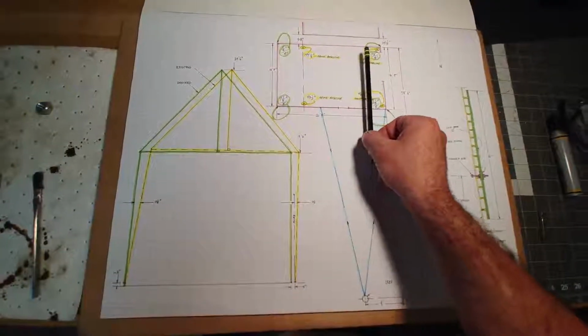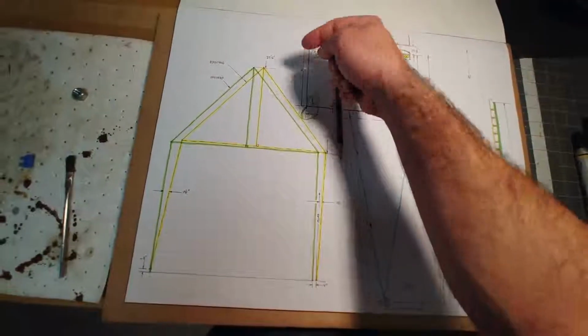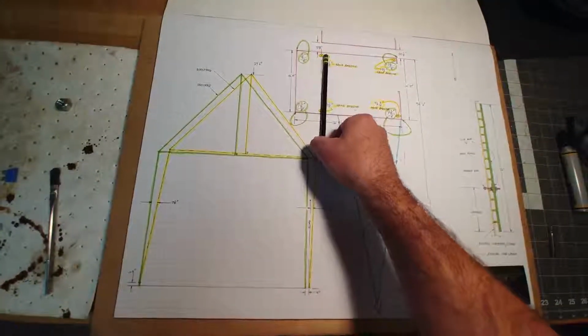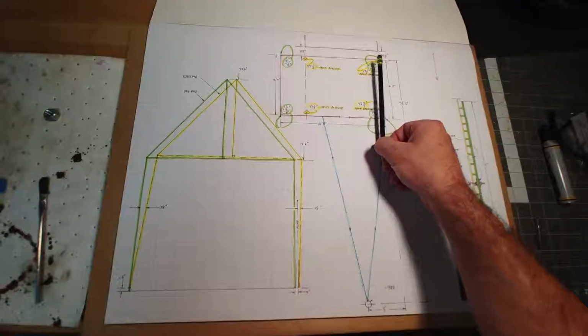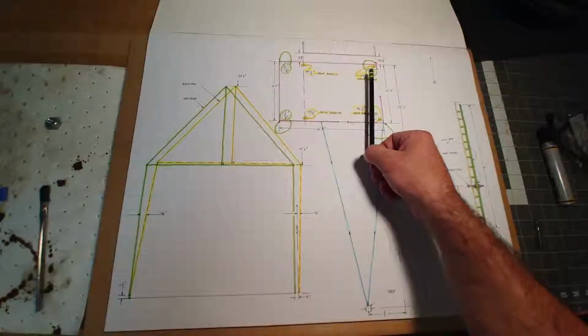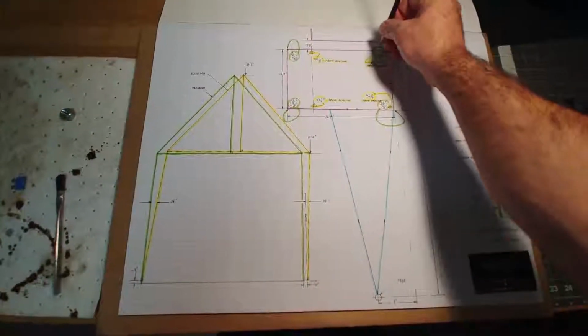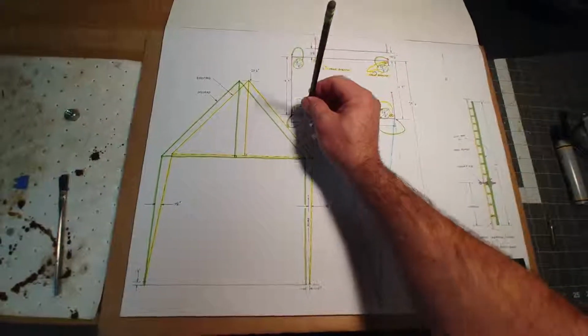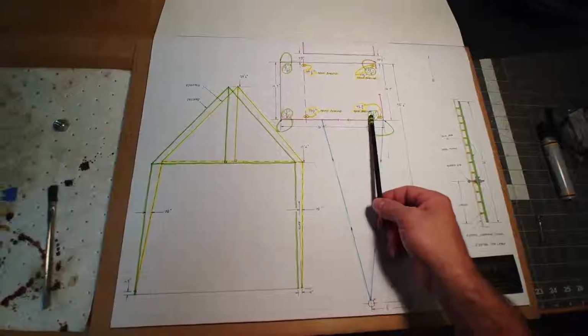There's second floor joists going all the way back to here, and then it's boxed out for the stairway to go up. So this is the last complete floor joist that there was, and obviously there's one at the front. With the laser going in here, I put my tape measure up and stuck it to the bottom of the floor joist, on this front one at both ends and the rearmost one at both ends, and I got a distance from the laser line up.